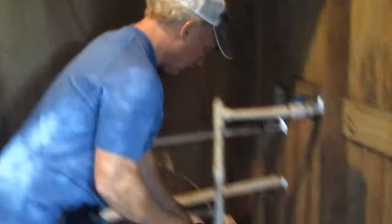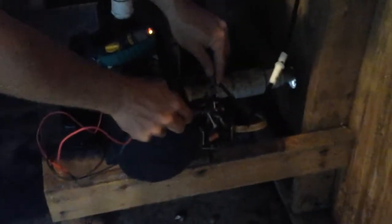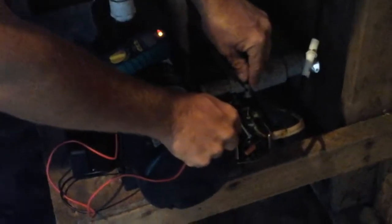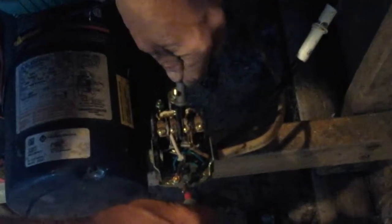We come back over and we check the lines coming in. And we don't have voltage there, but that's because the float's not down in the aerator. So if you carefully find your power, disconnect the wire nut. Now we should be able to bring the power line in and then touch the power here. And it's giving us 240 volts. So we know that's wired 220.